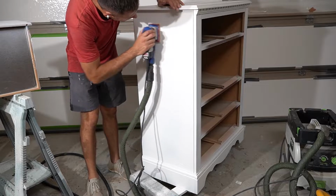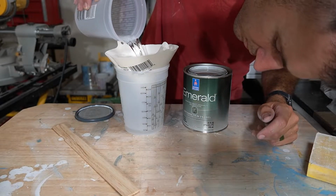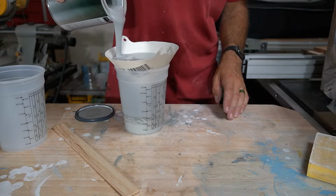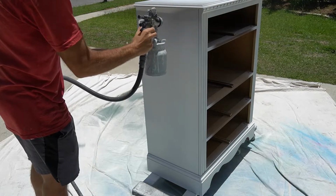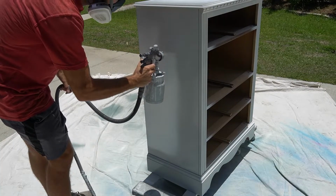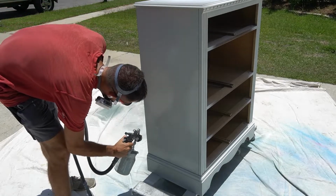Emerald urethane is pretty good as far as adhesion goes. You could really use it without a primer, although I'm not going to. So this is Emerald urethane. As much as I have a gripe with the dry time, it's so convenient. And I've never gotten any issues from thinning it. It's almost always consistent. I've never gone back and felt it and said, oh, this is tacky, this doesn't feel like it completely dried. So I think I'm just going to stick to it for now.